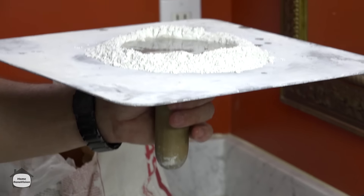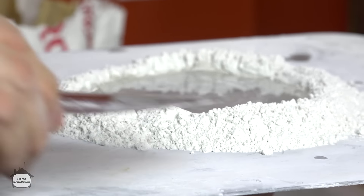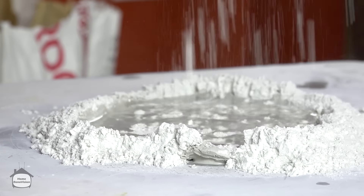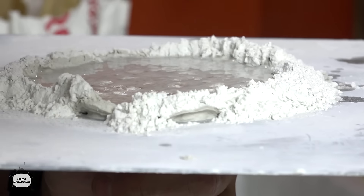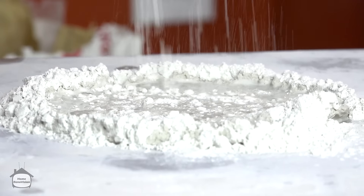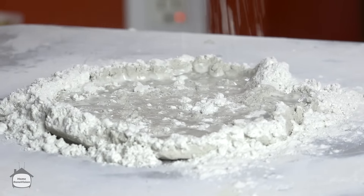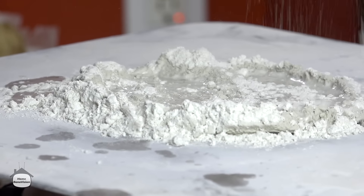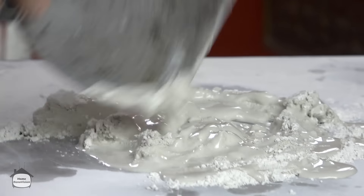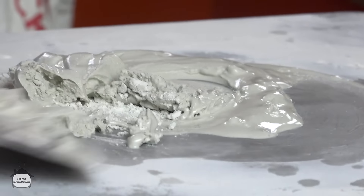You've got a couple options — you can leave it for about half an hour, but it'll harden faster than you can mix it. Or you just take your knife off the edge, lift up some of the loose powder, and shake it in there like you're icing a cake. Work your way around the volcano, ice your cake, and if a little bit starts to come out, don't worry — there's not enough water to cause a problem. Once you've gone all the way around the edges it should start to become more of a paste, then you can break it up and mix it right here on the hawk. No mixing tools, no pails, no muss, no fuss.